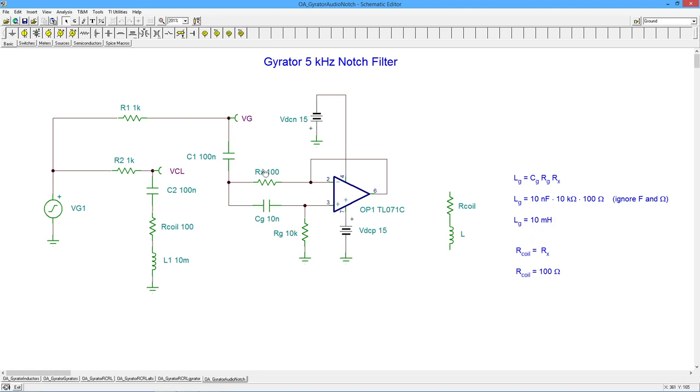Okay. Now there are some practical limits here, right? You can monkey these things up and down all day, but be careful about getting too small for Rx because that will possibly require large currents coming in from your source. Remember, at very low frequencies, almost all of the signal is going to drop out here. So this differential at some frequencies could get kind of large. You just have to be aware of that, all right?